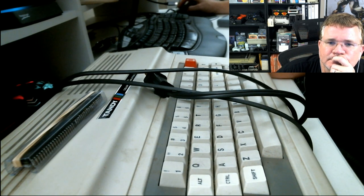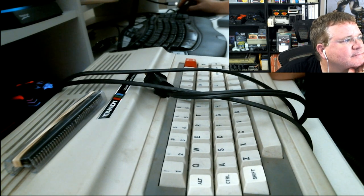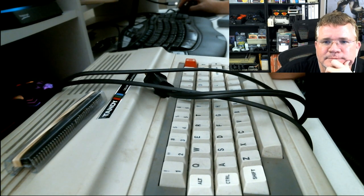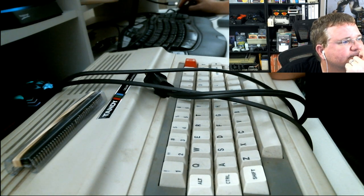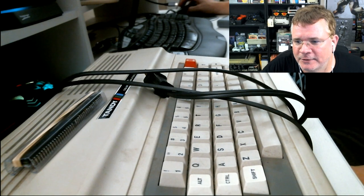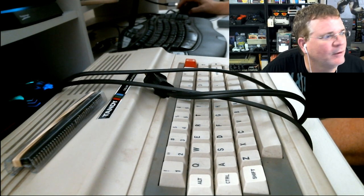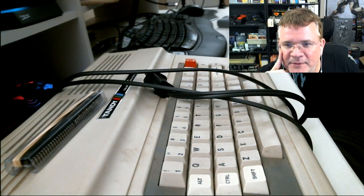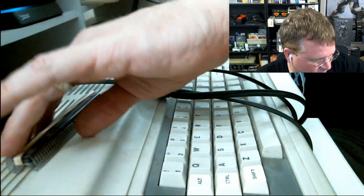A little chip you can get out, but if it has 40 pins, it's really tricky to desolder enough of it at once to get it to move without burning the board. Worse, when you pull it out, sometimes you'll even pull the traces up as well, the pads and the traces. If you're too eager to get it out, you're going to pull hard and you're just going to tear things off the PCB. Gotcha. Yeah. That's something I'm not willing to do.